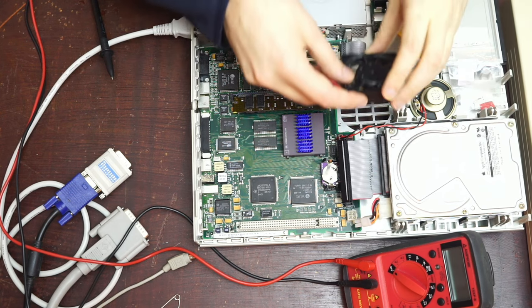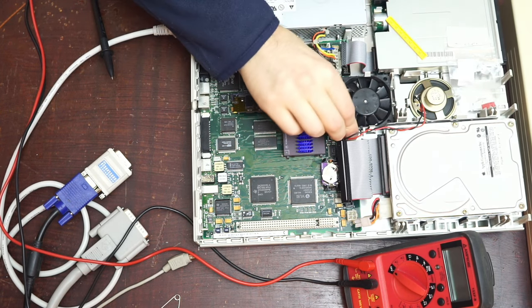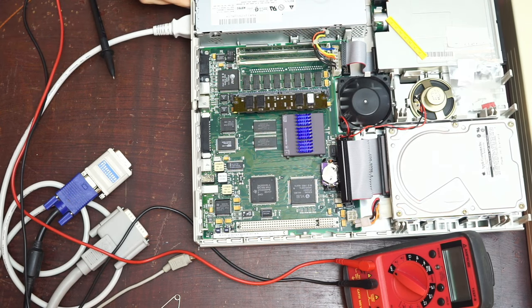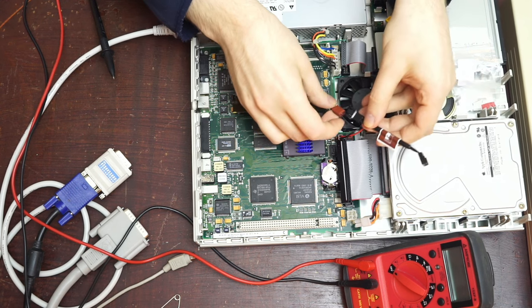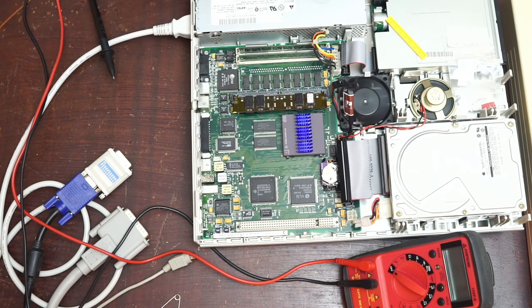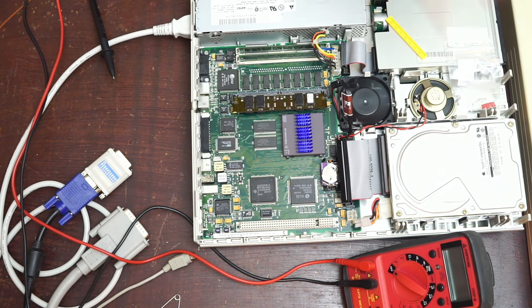And part of the thing that makes it so hard to hear is actually the dang fan. Because if you turn it on with the fan on, the fan is really very loud. If we take the fan and put it through one of the Noctua low noise fan adapters, it is significantly quieter. And so I think that's what we're doing. You know, the heat sinks on the CPU will help there. The hard drive's not being used, so that won't be generating heat. So I think it'll be fine with the quieter fan.